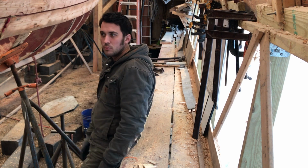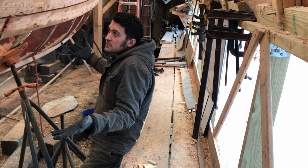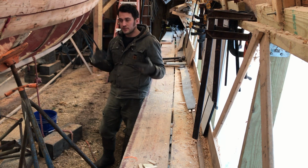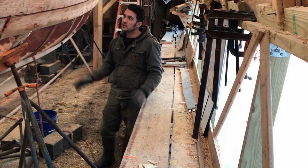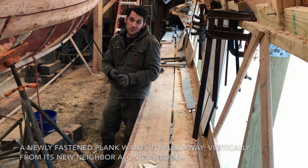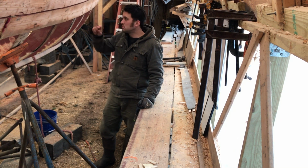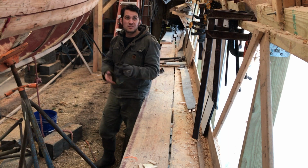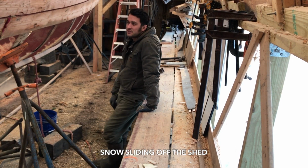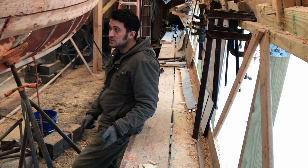They are also one of the best things when it comes to resisting shear forces. Where you do run into shear forces in the planking process is in putting them on. You don't get a lot more when the boat is sailing, when it's in the water, or any of that. But in order to actually get the plank situated and in place, you need to, what's called edge setting, edge set the plank a little bit. Until it's fastened and it's been this shape for a while and it's settled into it, the plank is gonna want to spring back. And as I've mentioned, screws are not great at resisting that. Trunnels, though, are really great at resisting that. So any place that I need to edge set any significant amount, I try to put some trunnels so that it stays where I put it, basically.